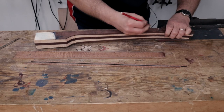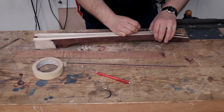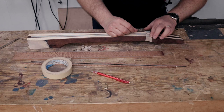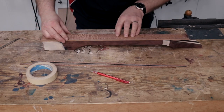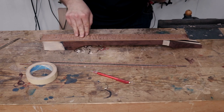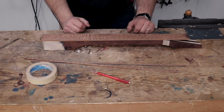So here's my nut. I'm going to do two things: put a pencil line and some masking tape there. The masking tape will fold over at an angle and not get in the way, but it's also much more visible than a pencil line. Visually it's slightly confusing because I've got maple and then the rosewood here, but that's all right. The main issue is whether this is going to slip and slide. I could glue a tiny sacrificial strip there, but getting it off might chip the neck blank, so I'm just going to wing this.